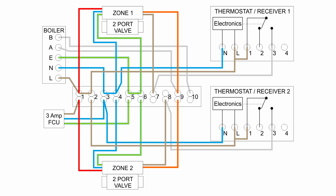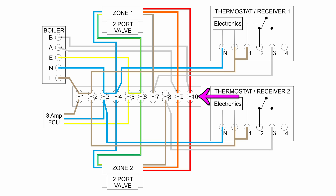The next change we need to make is the grey wires that go into the two zone valves. Currently these are connected to permanent line on terminal 1, but we don't want permanent line going in because that's exactly what we don't want to be shoving into the boiler. So we're going to remove those wires from terminal 1 and instead connect them to terminal 10 in the wiring centre. The grey and orange wires inside the valve don't actually connect to the motor — there's simply a switch inside the valve. When the valve is open, the switch will close and connects the grey and orange wires together. That switch doesn't have any voltage on it other than what we're putting on it. So all we have now is two wires coming from each valve which just has a switch on the end of it. Those two wires are then extended through to the boiler on A and B. So when the switch in either valve closes, it will make a connection between the A and B terminals in the boiler and turn the boiler on. Importantly, terminals 9 and 10 are not connected to mains voltage in any way — it's purely the wires from the boiler and the ones from the switch inside the zone valve.